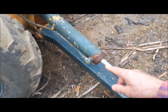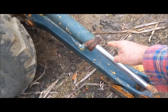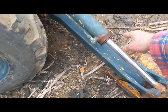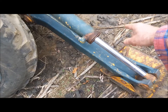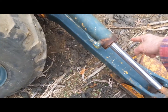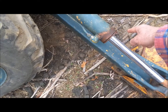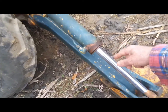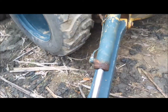Another thing these engineers do wrong is this gland seal here — there's no excuse for making it that paper thin, to where you can't grab it with a wrench. There is plenty of room on these cylinders where they're installed that they could have almost an inch-thick gland sticking out so you can put a wrench on it, even if they just had flat surfaces — two or four flat surfaces. When I put this back, I didn't even tighten it all the way to where it originally was. I'm not going to fight getting it off next time, and as you can see it doesn't leak at all — it hasn't leaked since I replaced the seal almost a couple years ago.